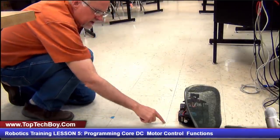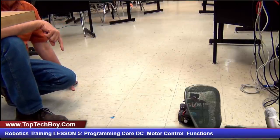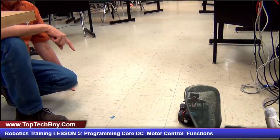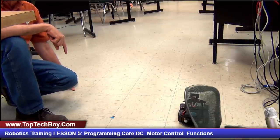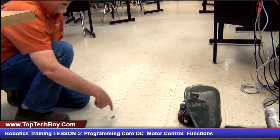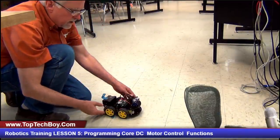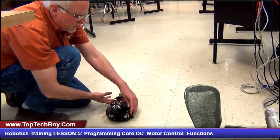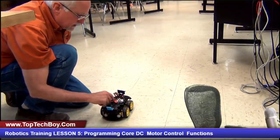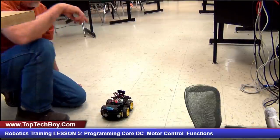Now you see that it's about a foot off from where it started. So in 10 feet, coming back, it didn't come back to the exact same position. The distance is exactly right. But what is not good is that it didn't come exactly back, which means if it did a right turn for 180 degrees, it didn't quite go like it should. It went a little bit less. So still, we need to drop that omega term a little bit. Let's try it again.